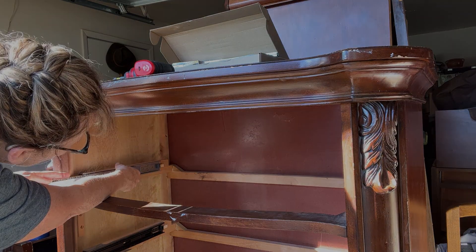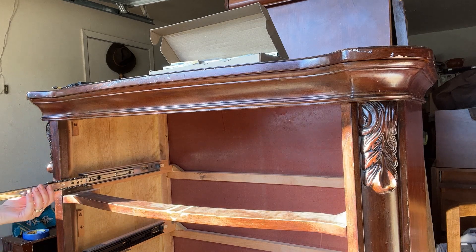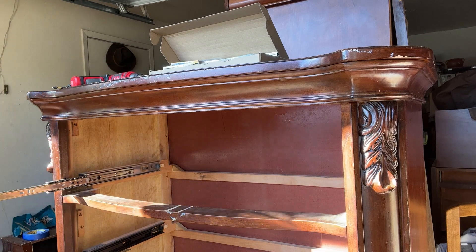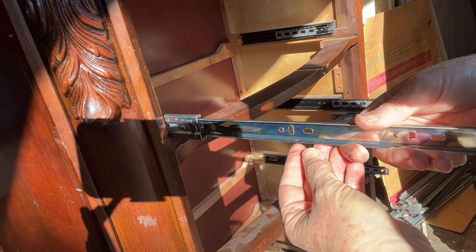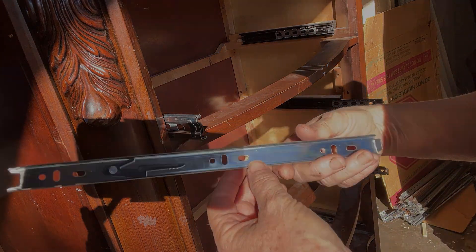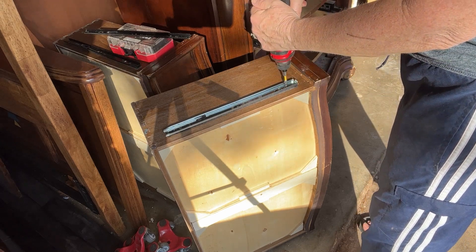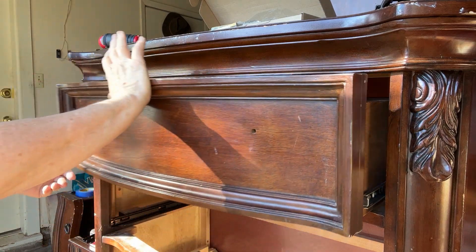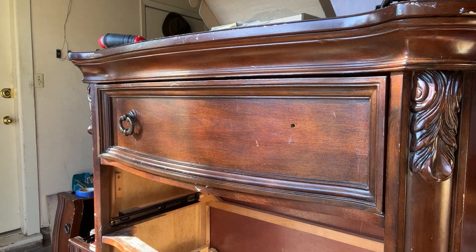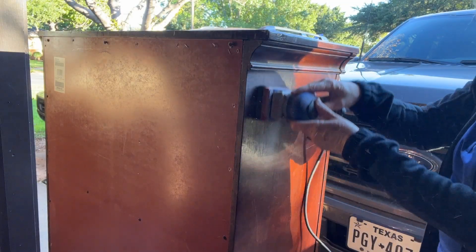Now, back to the installation of these slides. I'll be matching the main frame and sliders to the position of the original hardware. There's a lever that releases the sliders from the main frame, and these are attached to the drawers. Once all the hardware is installed, you'll just align the drawer and slide it into place. After the other four drawer slides were installed, I cleaned and scuff-sanded the dresser.